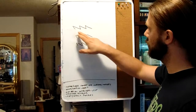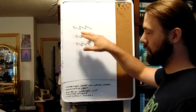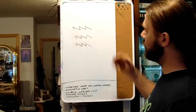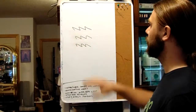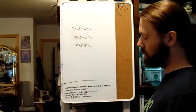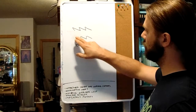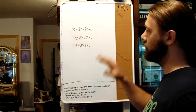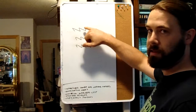And I hope you can see this good. This is a profile of the teeth thereabout. Excuse my crude drawings here, but this is what a file looks like new. You have this sharp cut on your teeth there, and of course it's going to work really good. So what happens when they get dull, especially if you start dragging them backwards across something, you round these teeth off, just like this drawing here. They get rounded off. They lose their efficiency. The file becomes dull, and you need to get it back to something like this.